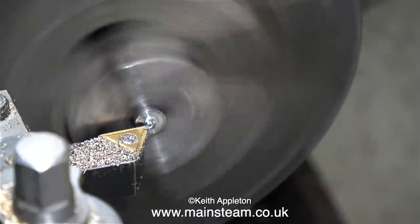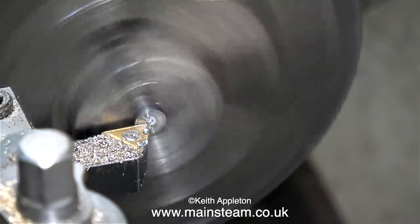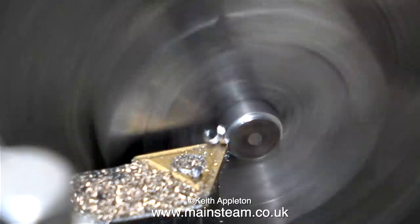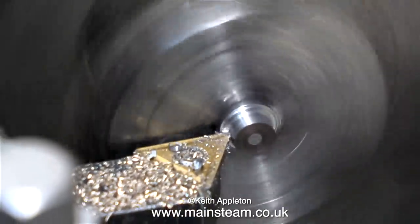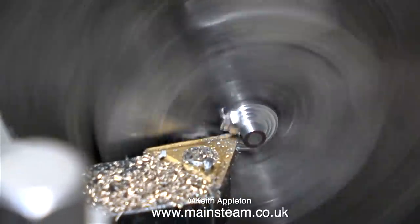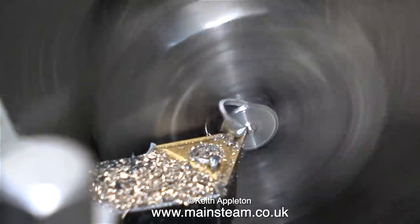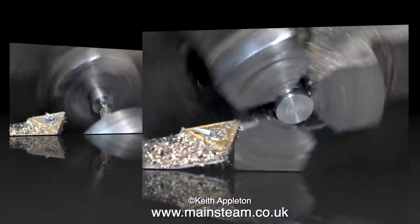Why didn't the part come loose in the chuck right at the beginning of the job? It's all a matter of speeds and feeds relative to the diameter of the piece and where the lathe tool is at any given time. The chuck is revolving at a constant speed, so the metal is going past the tool on the outer diameter much faster than it does when the tool gets nearer the centre. Maybe if I'd been more gentle with the tool and taken finer cuts near the centre, I wouldn't have had the problem. But it's never a good policy to hold a part by a very small protrusion that is too small to give it the correct mechanical support. I've refitted the part into the chuck, holding it by the main body, so it's not going to jump out this time.